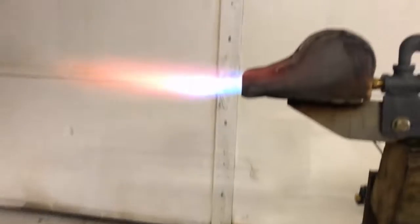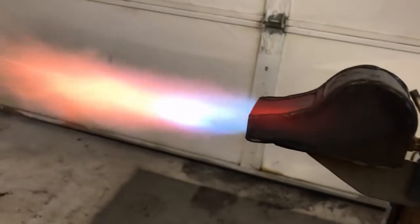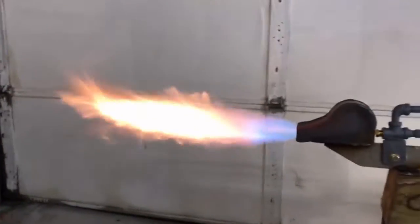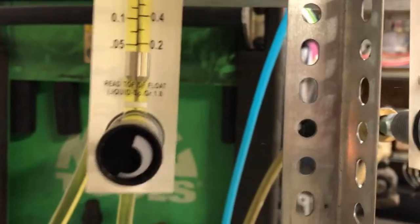One piece of advice: we have to get an oiled air compressor. An oil-free air compressor is just not good for 100% duty cycle. I've run those things on job sites before — you'll be lucky to get a year out of it, whereas an oiled air compressor you can get a lot more.